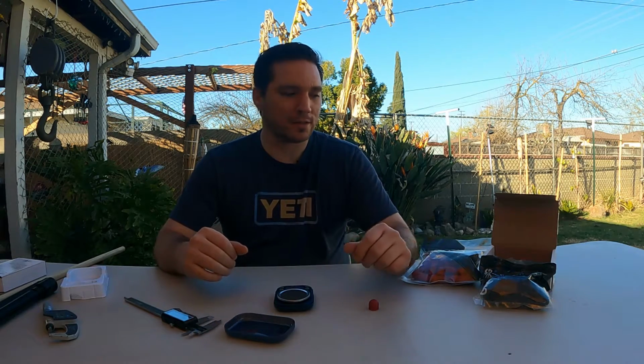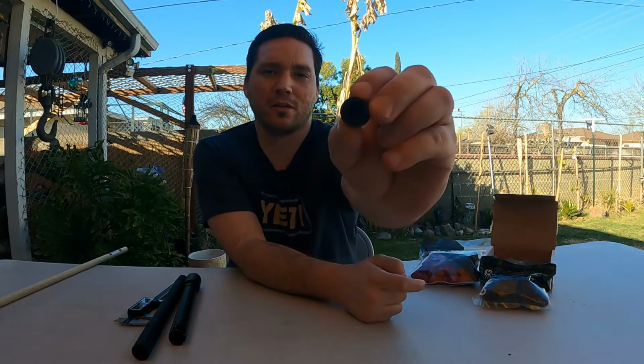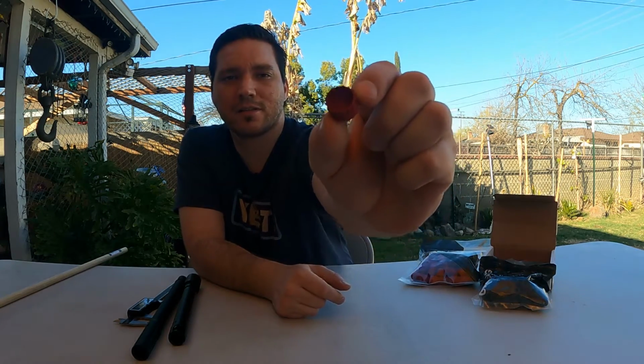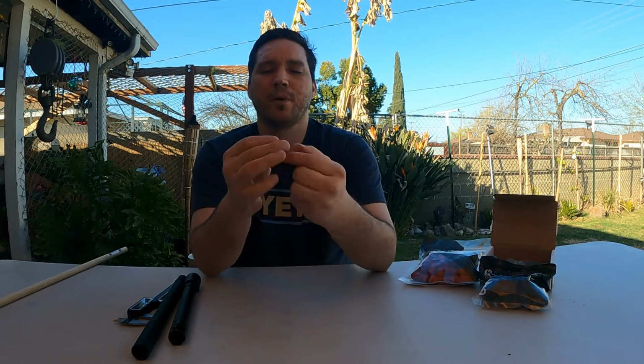It's all experimental, you know, for fun and for science here, okay? I'm gonna be weighting these to be heavier, okay? And I got a 3D printed jig, so that way I could gauge distance and depth here. And what I'm gonna try to do is, as you can see, Grimberg, they left their flange a lot thicker here to allow for weight, okay? And these projectiles here are thinner on the fins in this area, okay? But what this is gonna allow me to do is weight this how I wanna weight it, okay?